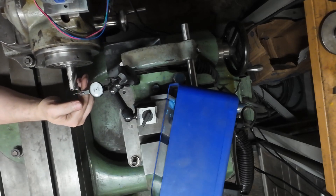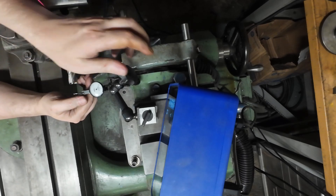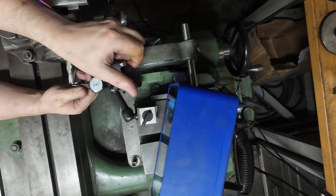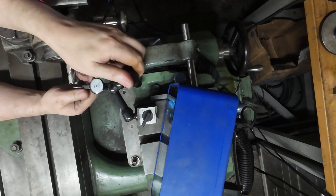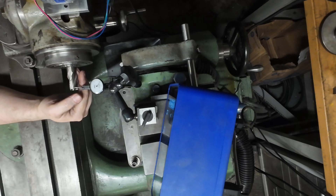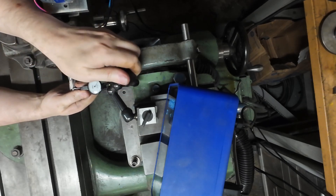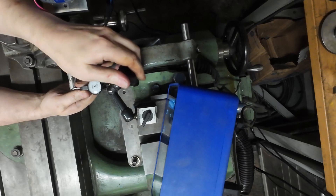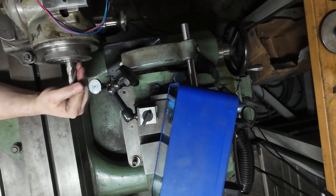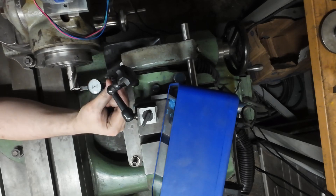What we're gonna be doing is indicating between two flutes. This is a four-flute end mill, and the helix angle allows me to do that. This is not always possible, but when possible, this is what I find to be the easiest way to identify our helix angle. It's easier done than said.